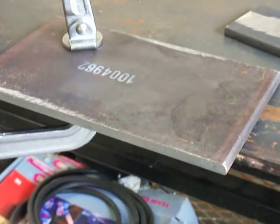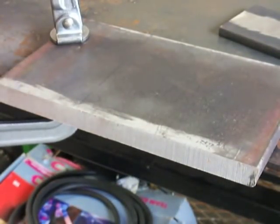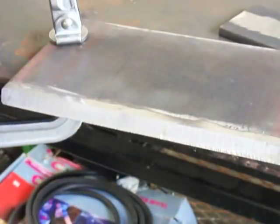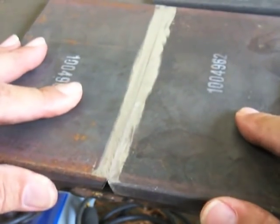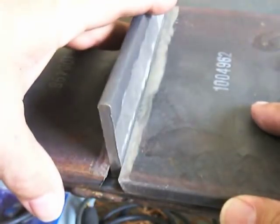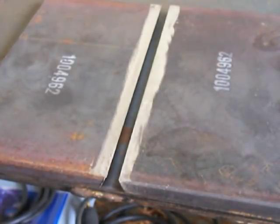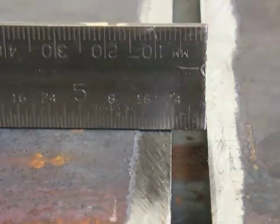Clean it about a quarter to a half inch away from the area to be welded using a grinder flapper wheel or whatever works. Don't put deep gashes in it — try to get a pretty smooth finish, but remove that mill scale from both sides. This test plate has a saw-cut bevel so it won't require much cleaning there. The easiest way to tack them together is usually face down, and to get that quarter-inch gap, just use the quarter-inch backing strap itself as your spacer.